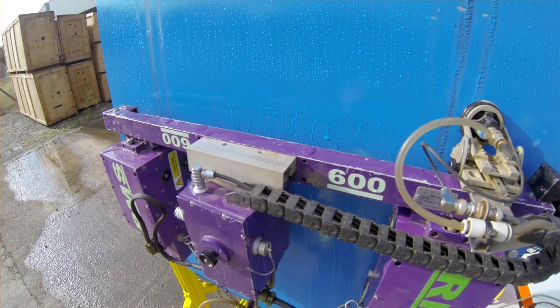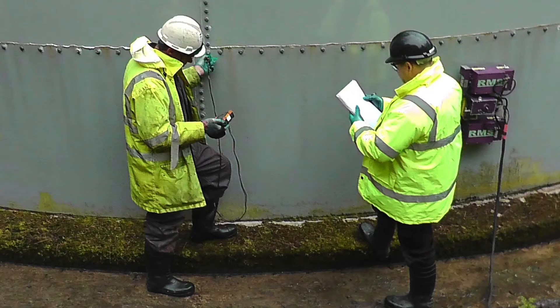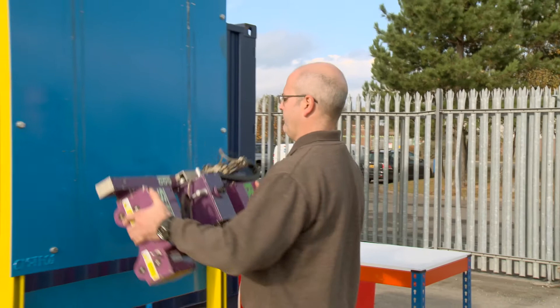It's collecting a swipe of 600 millimeters at a time, so it's very fast. It can collect a lot of data — namely a couple of square meters in a couple of minutes. So when you have a large tank of 50 meter diameter, it could cover a large percentage of that within a few days.